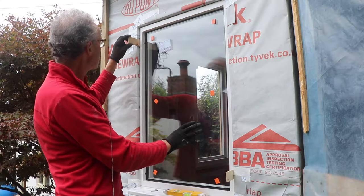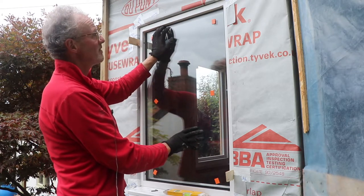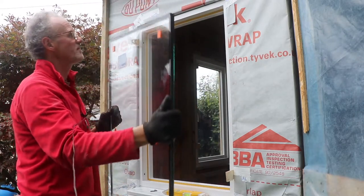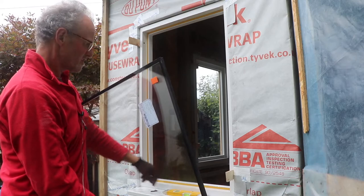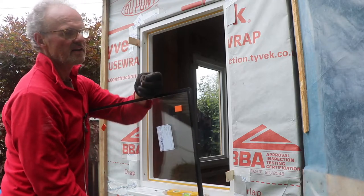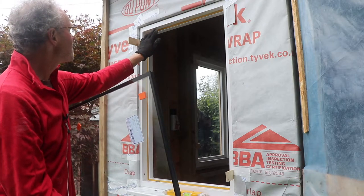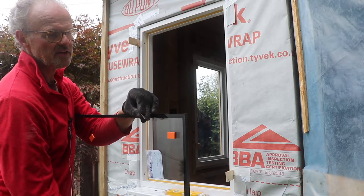I've put a little bit of a wedge in there and just re-screwed it, so that's helped to solve the problem. What I'm going to do now is just take off this backing here — double-sided sticky stuff — and then put this window onto here. But first of all, the little spacer pegs that I've been given are too deep when they sit on the bottom here for the frame to go in comfortably, so I'm going to have to find some little sprigs of hardwood that are a bit thinner and use them instead.